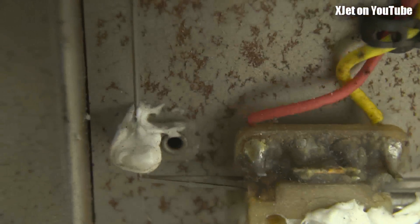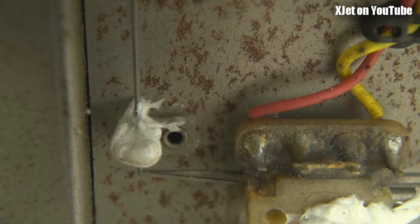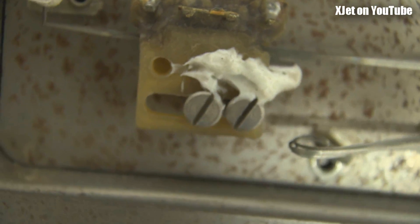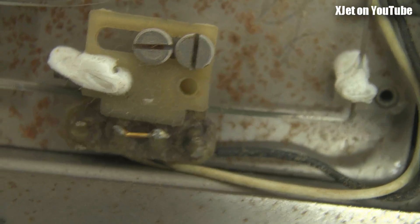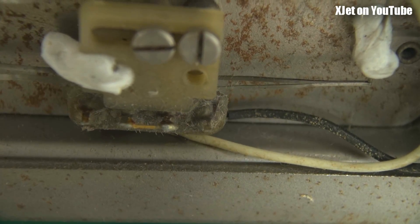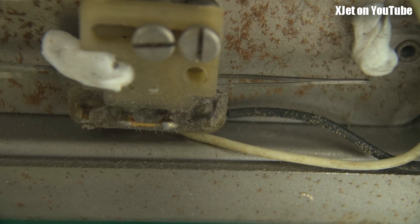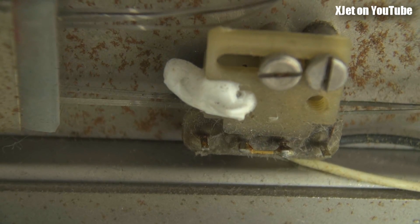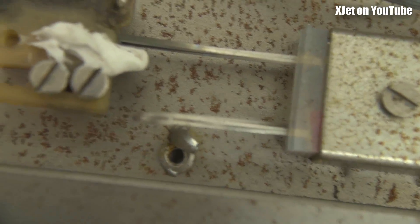I'll try and get an even closer look at those little nickel strips that basically twist the wire when the magnetic field in this device is activated. On the other side it's exactly the same thing but in reverse — little nickel strips wrap around the wire and they produce a push-pull motion when the twist reaches the end of the wire, which induces a magnetic change in the pickup coil. It's all very interesting stuff.